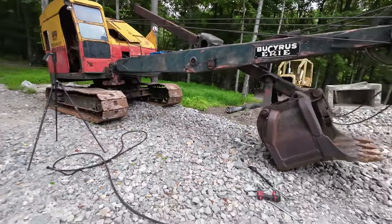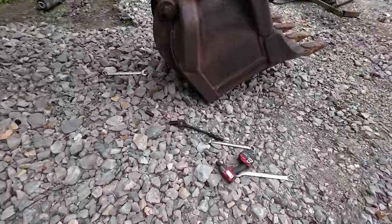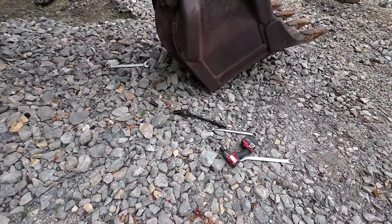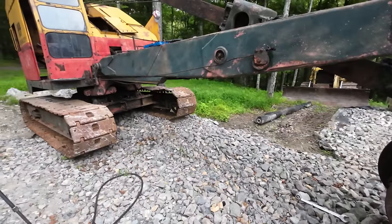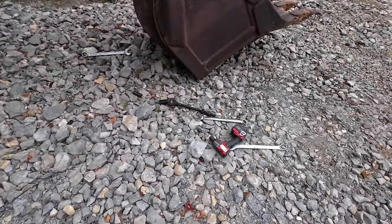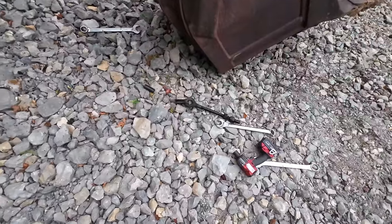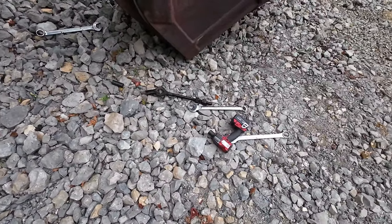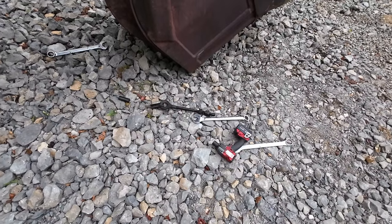And it has that turnbuckle on the end we took off. That's what tensions the cables. And you have to keep the cables tight, like we said before, so they don't get wrapped up on the bottom of the drum. But because you only have that much leeway, it basically comes down to pulling the cable in tight through this eye and hooking it with the cable clamps with that thing all the way loose, because wherever you clamp it, that's the starting of your tensioning point and then making up for cable wear going forward.